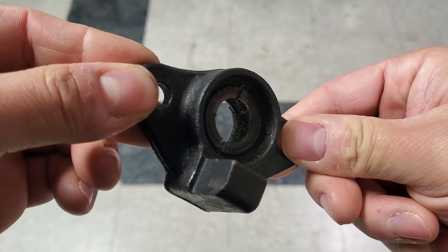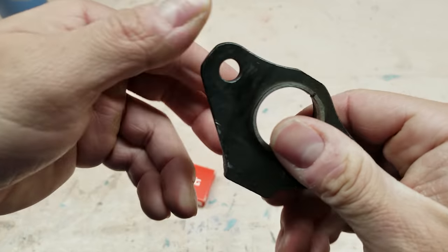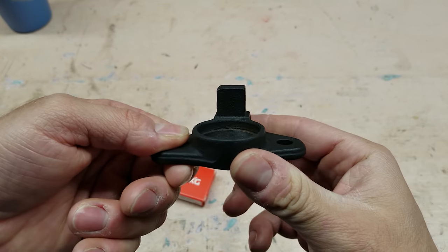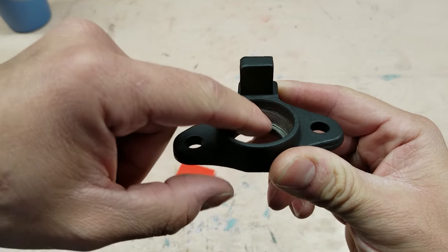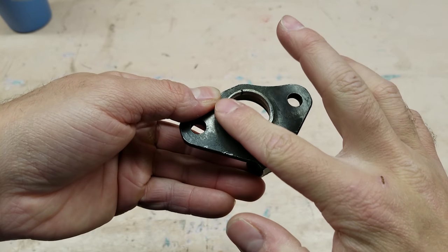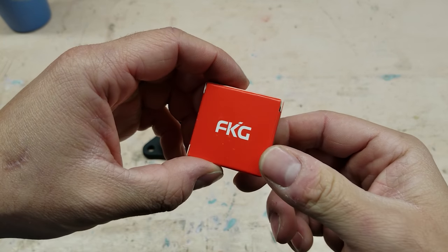What I did is I went up to Matt's place - Mechanical Hulk - his pop is a master machinist and he bored that baby out, left a little bit of a lip there. I would have never been able to do it this precisely. So it's just big enough for a 30 millimeter bearing - just a regular ball bearing. I'm going to press the bearing in place; it'll rest on that lip so downward pressure can't push it through. Then there's a washer on this side so when you're pulling up on the stem it can't come out. This should be pretty solid.